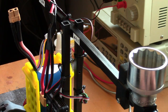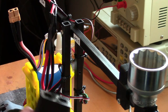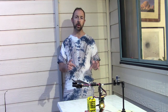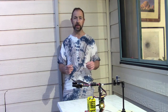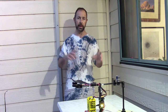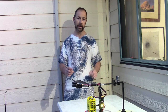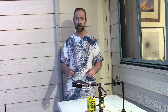At higher throttle positions I notice that the structure does tend to twist a little bit. So one late addition to the design is an extra little piece of bracing that you can slide down these carbon fibre tubes. I'm now ready to really test this motor at higher throttle percentages. While I wasn't too worried at 10 or 20% throttle, as we go up towards 100% throttle, I've moved it outside and I'm going to be looking through the steel mesh gauze door to take the readings from the scales. I really can't emphasize the idea of safety enough.